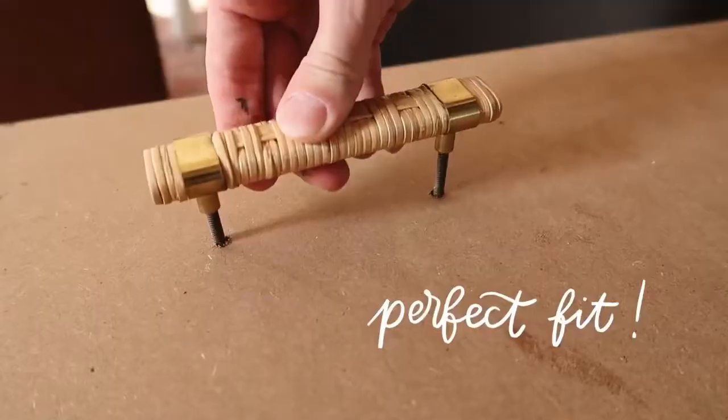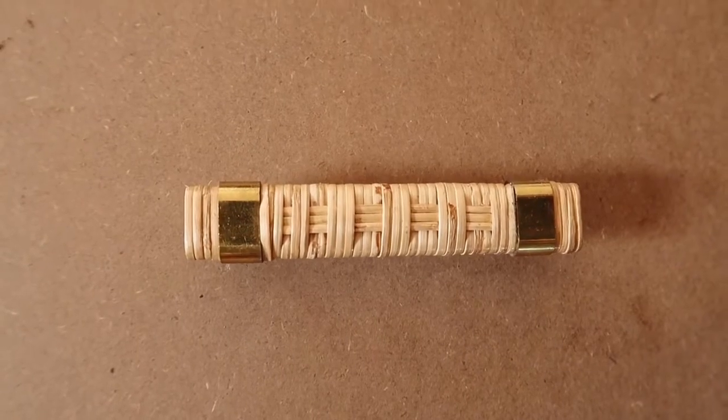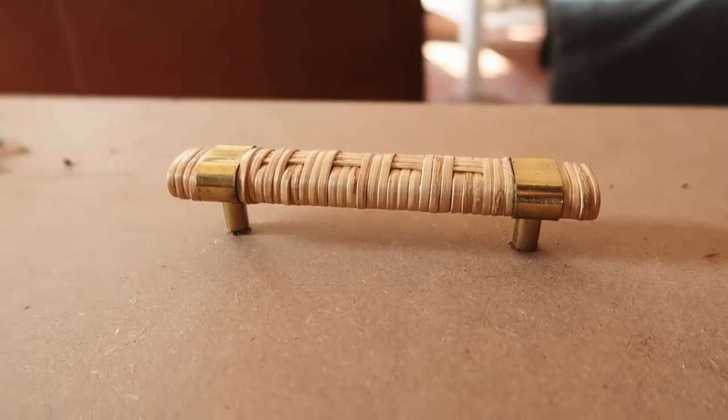Remove the handle — you'll have your lipstick spots, which you can use as drill holes. Drill right over the top of those and wipe away any excess lipstick. That gives you perfect placement every single time. I also like utilizing a laser level or ruler in that process just to ensure the placement is centered, since stamping alone can't guarantee it's perfectly centered. You can also transfer the stamp to a piece of paper first to get the width, then use that paper on the cabinet to make sure the handle will be straight once added.